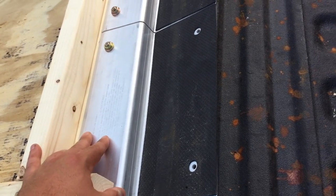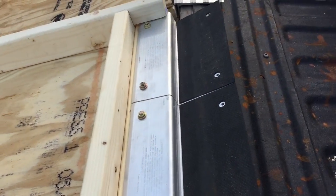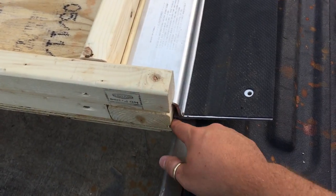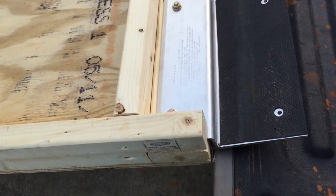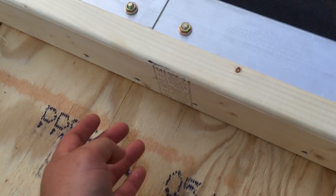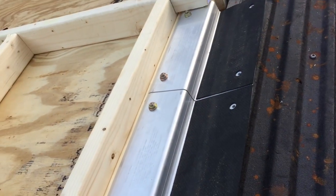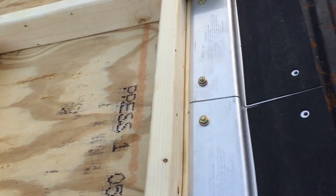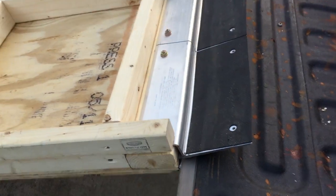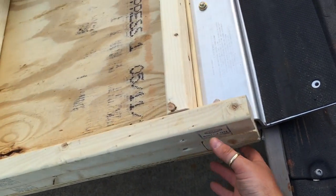This part is a little unconventional — what the manufacturer wanted was to take a 2x12, lay it on its side, and I was basically trying to repurpose the bracket in a different way. What I did was cut a relief right here in the end of the stretcher, put the bracket in, and got a bolt that bolts it to the skin. Then I went back and fastened a row of fasteners between them to help stabilize the board. These are rated for 700 pounds each — if I was carrying anything heavier I'd probably put a diagonal brace or some backup structure here.